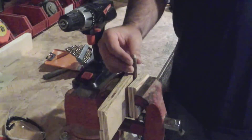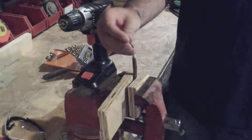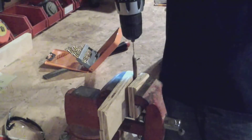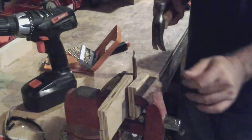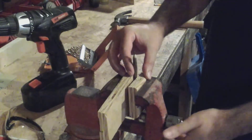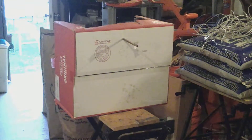The initial test seemed okay, but I wanted to step it up a little bit. I'm going to sink a nail with the head cut off into the tip to give it a little weight and a little punch. With a little trial and error, I've adjusted the bolt holder so the string gets a good grip on the back of the dart. Oh yeah, I think I like that.